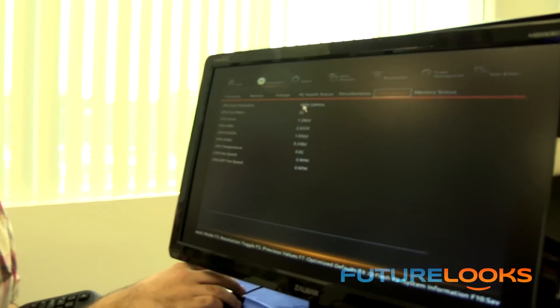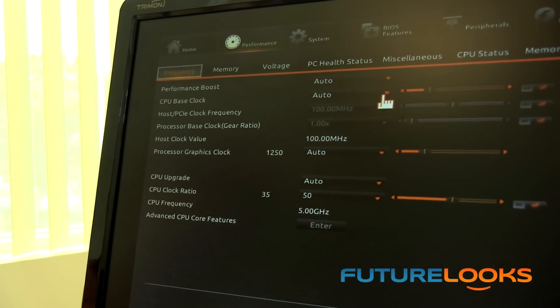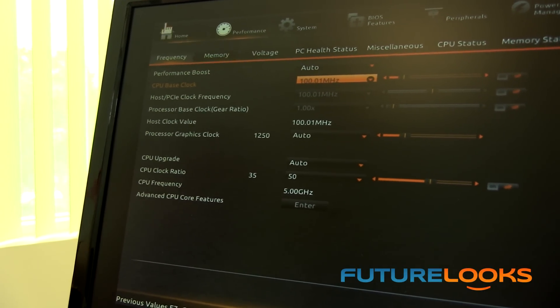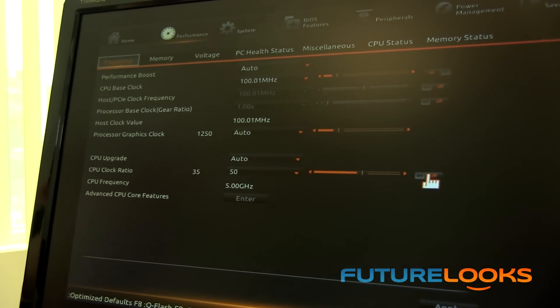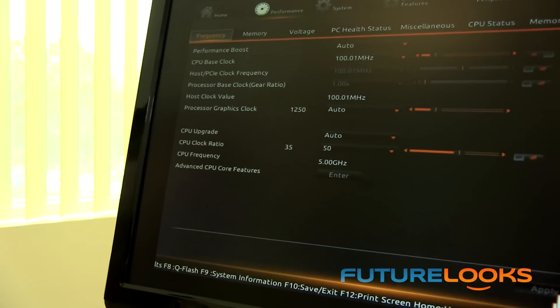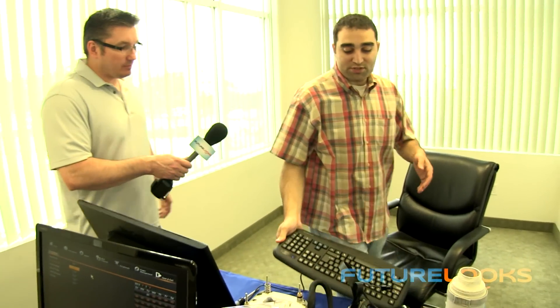Let's say I want to increase something on the fly. CPU status right now is 4989 — let's make this an even 5 GHz. So I go to CPU base clock, select it, and type in 100.01. That hasn't applied it yet — but I hit on and then hit apply. You see how the options that can be changed on the fly each have a toggle? If I change a setting but don't toggle it on, when I hit apply it won't change that value — it only changes what has the toggle on. Press apply, and it should have worked. And it did — we saw that work in action. The features are really good, awesome for LN2 overclocking. This board was developed by HiCookie, and he worked really hard with the engineers to get memory overclocking, CPU overclocking, and base clock overclocking dialed in.